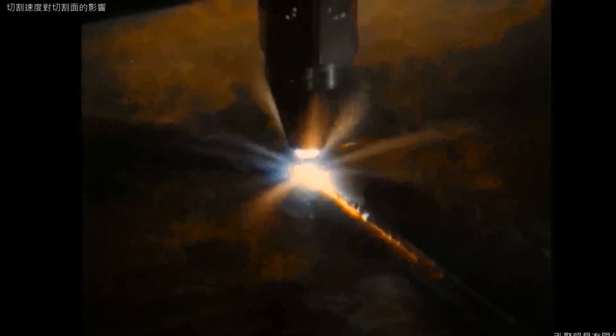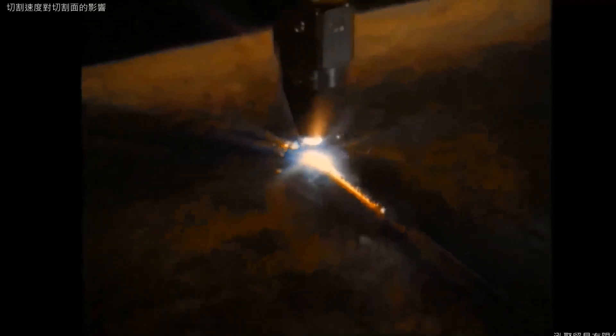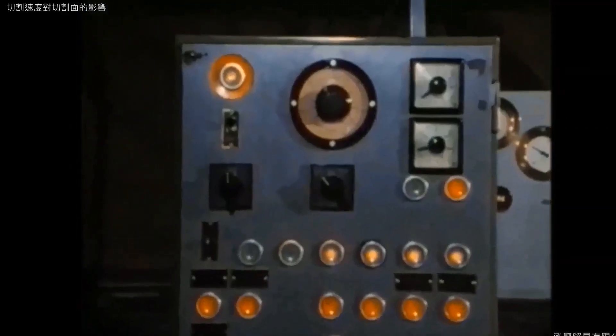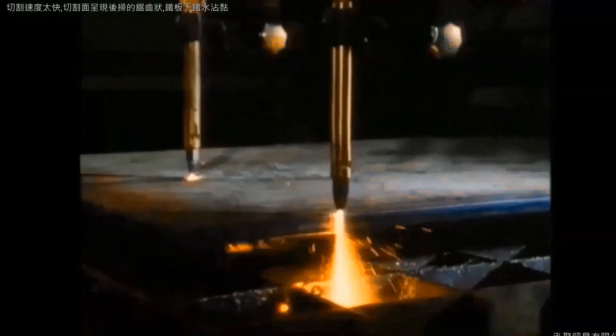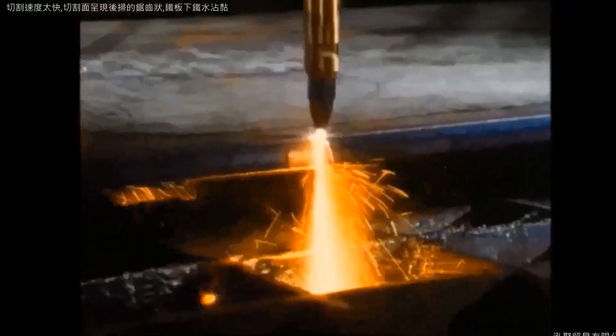A comparison of all three cuts makes it clear that it is really essential to maintain the pressure specified by the manufacturer for the nozzle concerned. But it is not only the correct cutting oxygen pressure that is important — maintenance of the correct cutting speed is also vital. This speed is also given in the cutting table and will be examined in the following sequence. In this case too, a cut in the plate and parallel to it, a trimming cut.